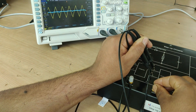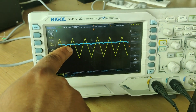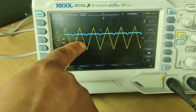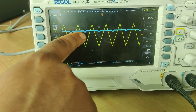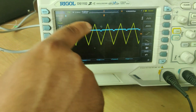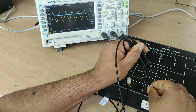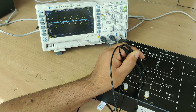Interestingly, if I shift the reference signal higher, the on-period will be very small compared to the off-period. Now the sawtooth wave has a smaller value for a larger period of time, and a higher value than the reference for only a small period. So depending upon the PWM value I am shifting, my switching will be affected accordingly — my pulse will change its duty cycle.